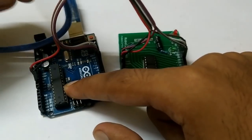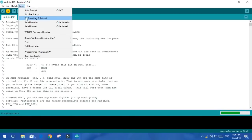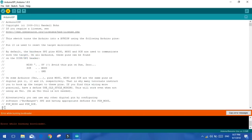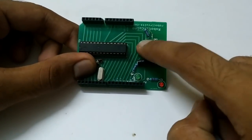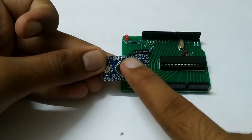Now reconnect the USB to the computer. After connecting the SPI pins, go to Tools and change the programmer to Arduino as ISP. Then go to Tools again and click Burn Bootloader. Our bootloading is done. Remove all the wires and set the Arduino aside. This DIY board will now work like an Arduino Pro Mini. An Arduino Pro Mini only has a microcontroller, some capacitors, and resistors — and this board is the same.